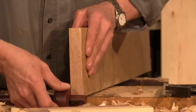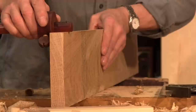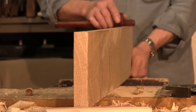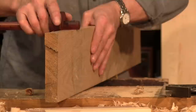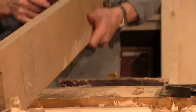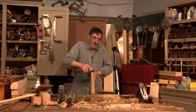The way I can tell: because this was cupped in the middle, I go on this end and I can see the gauge line is almost right on the edge — which means I probably will be able to get a good one-inch board from this. So I'm going to run a gauge line down here as a guide so I can see how much I have to take off — more on this side, less on that one. There's quite a big belly in the middle here. From the other side it was hollow, so we've got one-eighth here, a sixteenth there, but this will make the whole board parallel. I've got to take a full one-eighth of an inch on this side, diminishing to almost nothing in the middle.